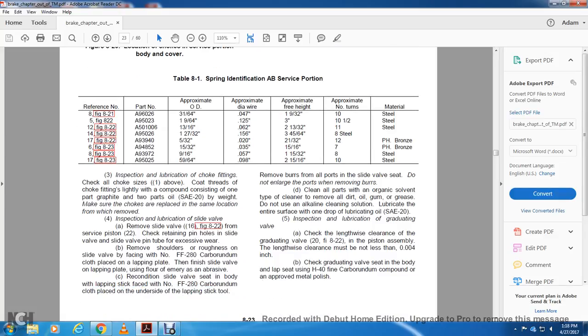4. Inspect and lubricate the slide valve. Remove the slide valve, figure 822, from the service position of the service piston. Check the retaining pin hole of the slide valve and slide valve pin for excessive wear. Remove the shoulder roughness of the slide valve by facing with number FF280